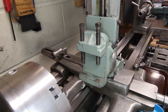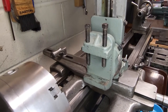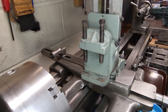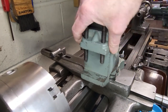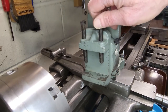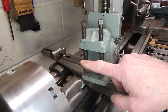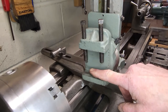So that is the Atlas milling attachment mounted to the South Bend lathe. You have your cross feed travel this way, and you're up and down this way. The actual vise will swivel vertically and horizontally, and of course you clamp your work right here. There's a set of jaws that come with this with a V-groove in them for holding shafts, that kind of thing.